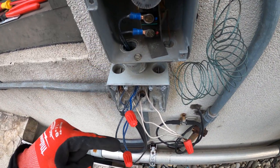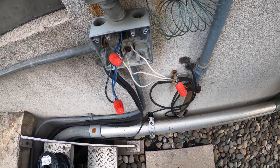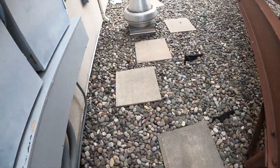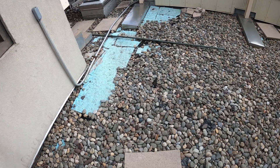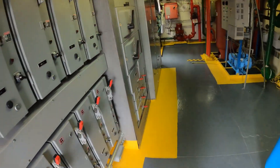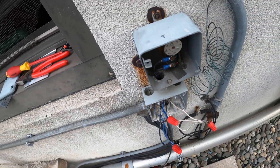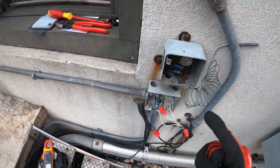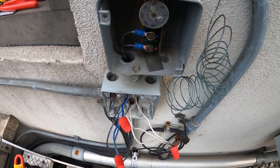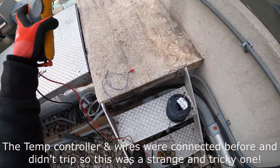What I did is I replaced the wires from here to here — I ran two black wires. I'm going to turn on the breaker and see if it trips, and at the same time check for amps. I did connect the heaters over there. When there are emergencies your mind is racing, you're working fast, you might slip up — but at the end of the day it's about catching yourself and fixing the problem. Never rush. Turn that breaker on — give it a few minutes. If everything stays on, it's not the controller, and all it was is one of these two wires leading up from here to the controller. This one's pulling an amp, and that's the one that's actually getting warm. We fixed the short issue — it's 85 degrees now.